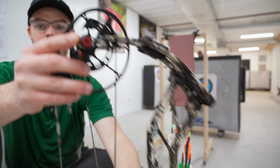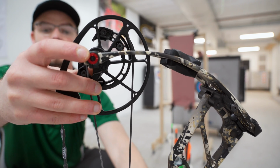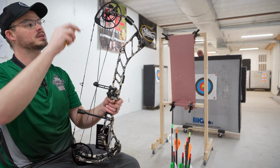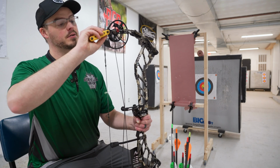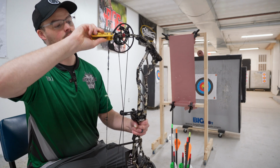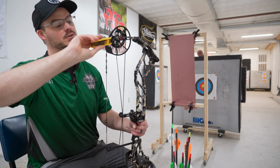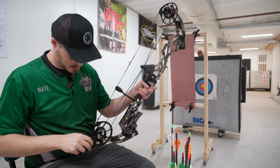My witness mark up here at the top. I always thought this was the witness mark when that's just clamped. The witness mark's up here at the top, and I have that lined up there. So now I'm gonna take my 1/16, and I am gonna lock this down. Now these little screws here, you'll hear them. There's no Loctite, it's just anodizing that's in there. They're just dry. So you don't need to reef on them. That's good right there. A little finger tight.